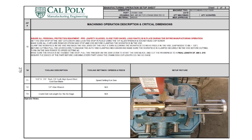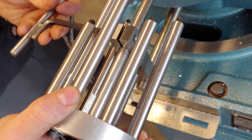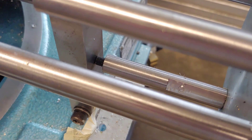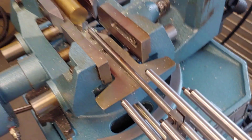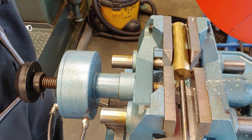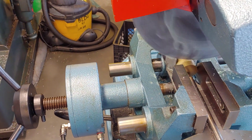Starting with operation number 10, we're going to use the cold saw to cut the blank for the workpiece. We'll cut it to a 0.6 inch length, using a hex key to loosen the saw stop and adjust it to that length of cut. Then tighten back up the saw stop and put the bar of brass in the vise, using the hand wheel to tighten it. We then set the speed of the saw — brass is a relatively soft non-ferrous material and we can cut it at a fast cutting speed, so we're going to run the saw at speed 2. Once set up, pull out on the trigger on the handle and ensure that coolant is flowing when the saw blade turns on.